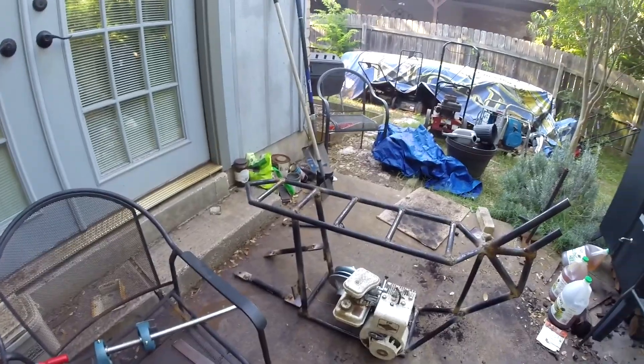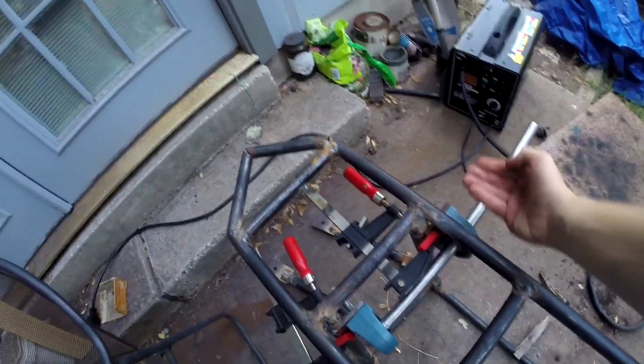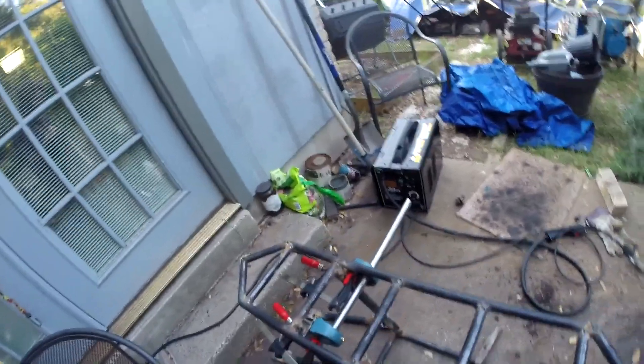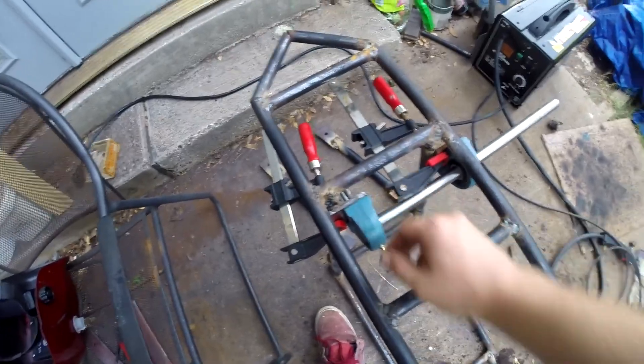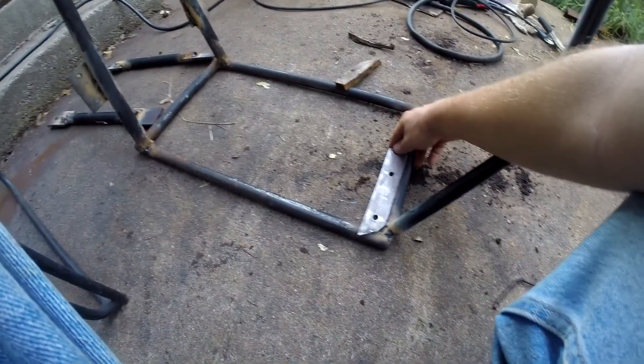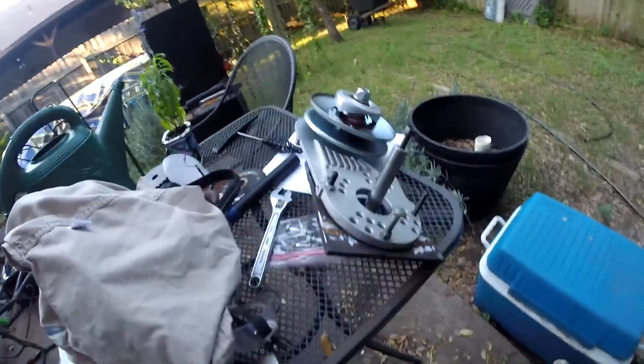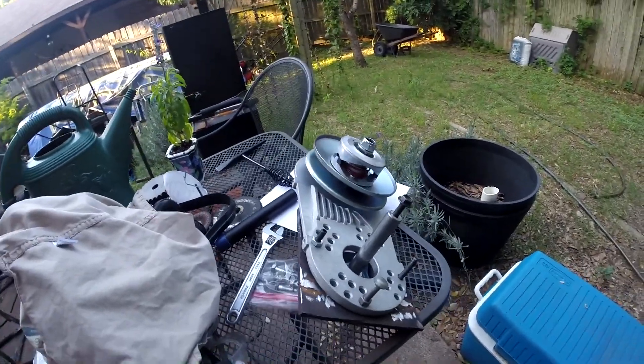Alright, so I'm about to start welding. I got this second jack shaft clamped, and I checked the sprocket that goes on there — the end of it only goes to about here, so I can cover that. I want it to be as high as possible to get as much material for the swing arms. It's a little bit at an off angle but that's okay — if I need to, I can fix that by adding washers. I think what I'm going to do is tack this for the base by hand, just by feel, and then screw the engine to it. Last clip for today — it's dark. I got this thing mounted for the jack shaft to mount on, I got the second jack shaft, and it's in the right spot. And also I got the engine mounted.